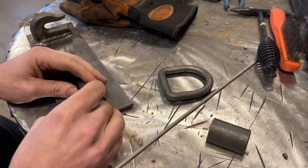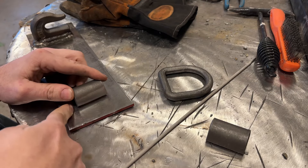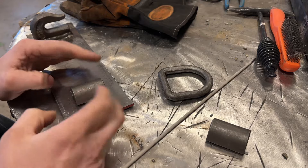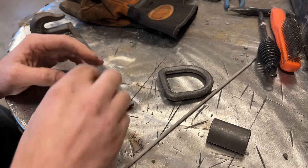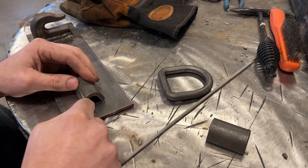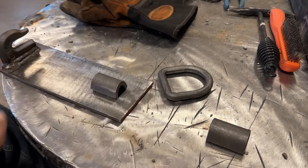If this is put somewhere with very limited access and the weld can't be much wider, you may need to bevel it out wider to get the weld thickness matching the D-ring without going far out on the plate. Realistically in most cases, how far the weld extends off doesn't really matter if it's on a trailer. I'm going to weld one with eighth inch and one with 3/32. You want to tack and preferably weld the corners of this - not just the face. You want to round the corners with your weld.